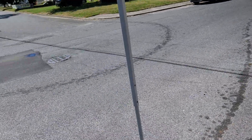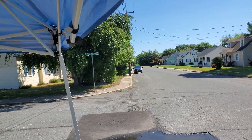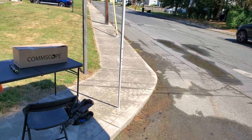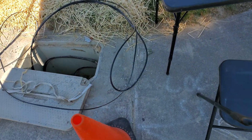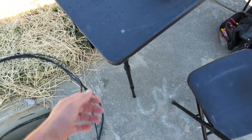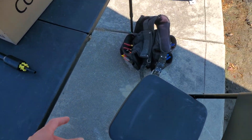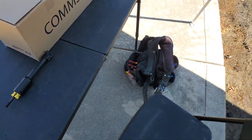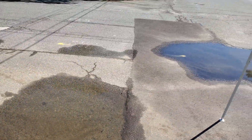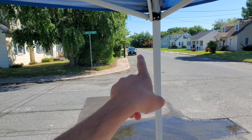We're about 2,500 feet from where we were yesterday. There's a lateral build here — this is a 24-count cable with a flat drop bundled with it. We're going to be doing a mid-slit entry on that. We've got our CommScope FOSC-A case and a flat drop adapter, which is quite nice.